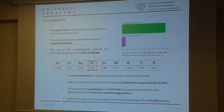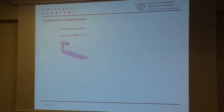High resolution micro-computer tomography is a major tool in the analysis of these brittle iron-rich inclusions. It also enables comparison of the morphology of the inclusions before and after heat treatments. The alloy was obtained from an aluminum 25% iron master alloy.